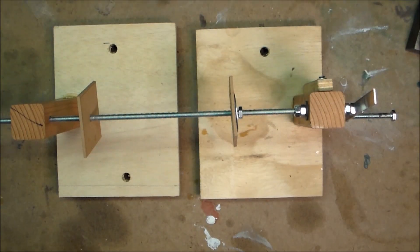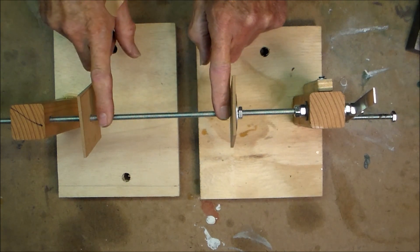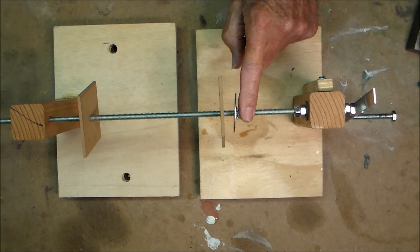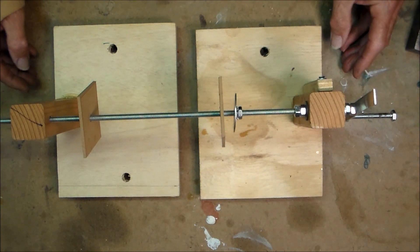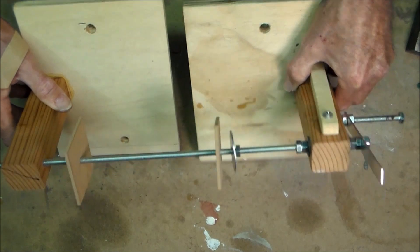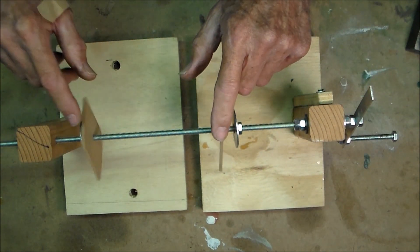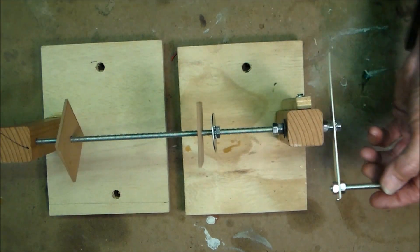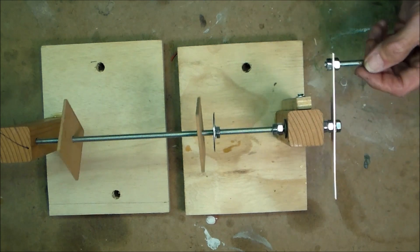So what I have done is design and build my own coil winding jig, adjustable for different size coils. I began with a trip to Home Depot to buy a length of quarter-inch threaded rod, plus a few nuts and washers to match. Everything else is made from scrap lumber — two verticals, two masonite pressure plates, and a little crank made from a piece of scrap metal and a big long bolt.